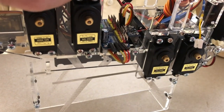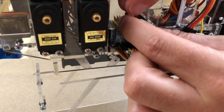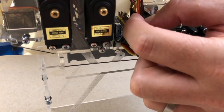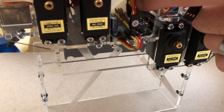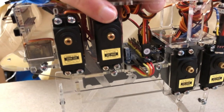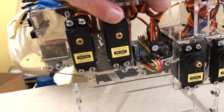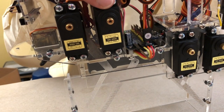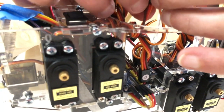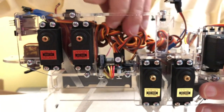We are going to start with number zero. The order matters here — I'm going to put this first one on and they are all going to be exactly the same, but it matters. With the number facing the camera: the brown line is ground, the center line is power — 5 volts to the motor — and the orange line is signal. On almost all of these boards they have color coded the connectors with black, red, and yellow. Red is in the middle, black is on one side, signal is on the other side. Make sure you get those in the right order. Now I've got all my motors connected. The wire is nice and twisted in there.